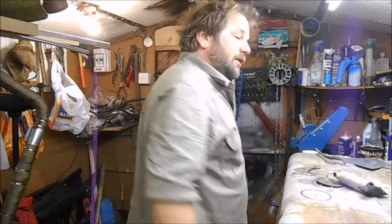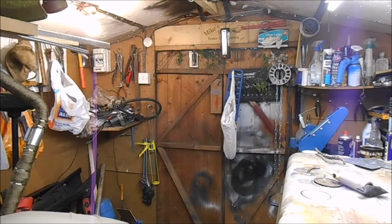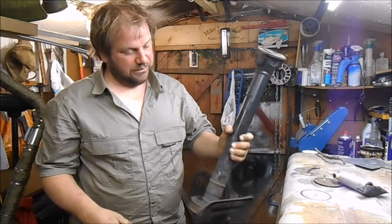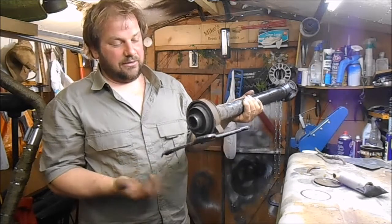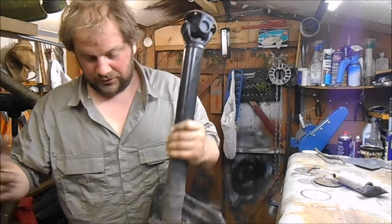So that's my next move. Tomorrow, now I've got the engine and gearbox fixed in place, I'm going to take some measurements off the prop shaft because the prop shaft has got to be shortened. I've got to have the Volvo prop shaft — the front end of that has got to be welded onto the existing prop shaft on the van. There is a centre bearing on the van, and a UJ behind the centre bearing, then that goes onto the diff with another UJ.